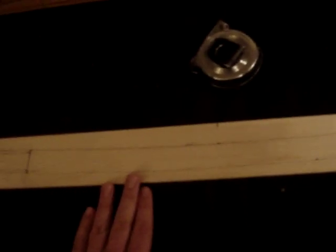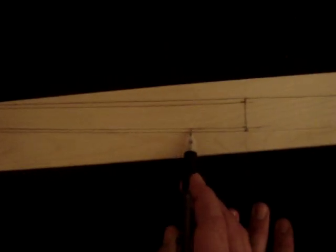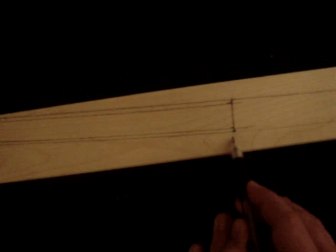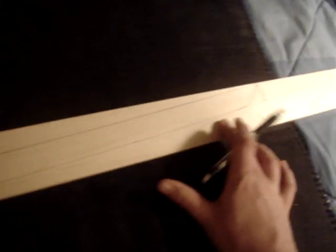And you're just going to take that and cut that out with your coping saw. So remember to cut out this notch right here. Don't worry about this line or this line, so that you have it cut in, notch out, and then make sure you cut along your line and then cut your blade out. So that's it for this segment. I'll pick you up again once you've cut this out, and I'll show you how to shape the rest of the blade.